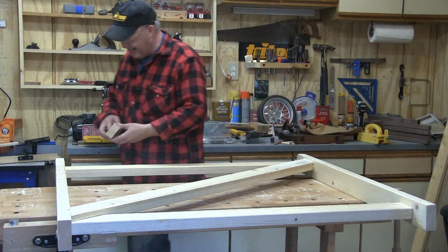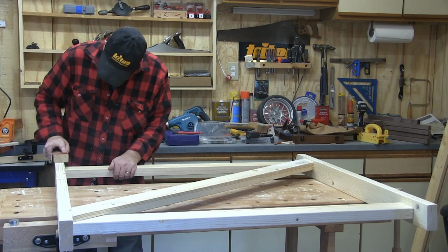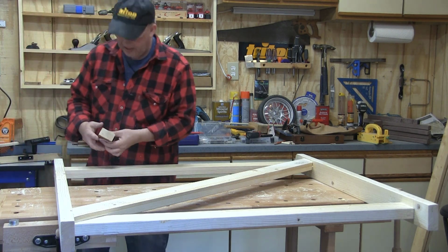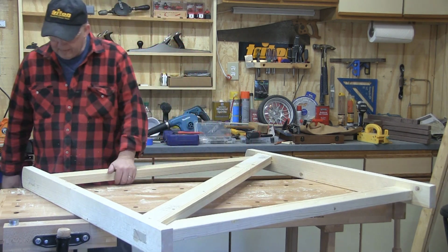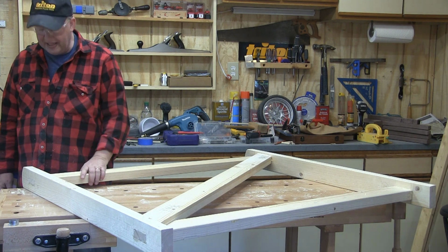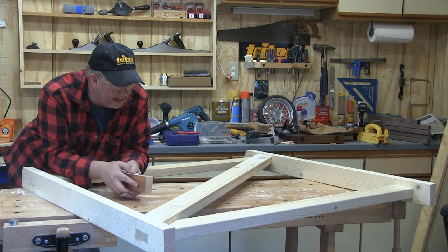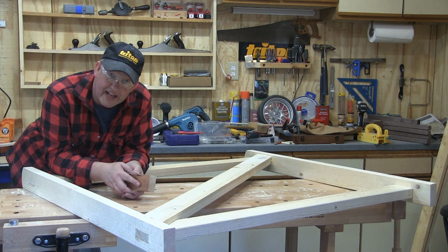So that is a joinery gate. I could have made it in probably a fifth of the time, just using a screwdriver and all the modern trimmings, but sometimes it's nice to do some joinery and spend time doing a through mortise, even though there are faster alternatives. But I have to wonder if this would outlast anything that's screwed together. Dowels are going to stay put, they're glued in, they're not going to move. Really it's about longevity when you do joinery. It should last longer if I use joinery on a piece of work. So only time will prove that out.